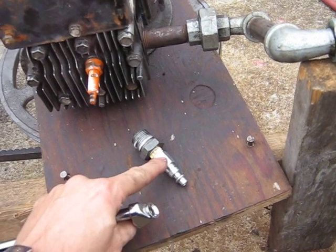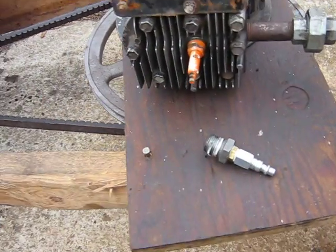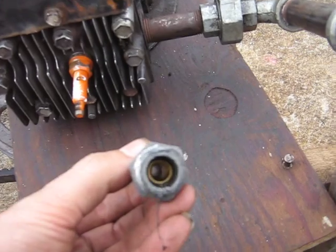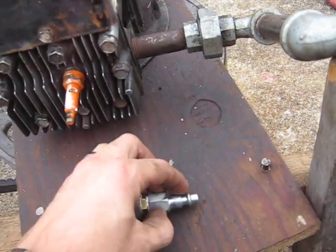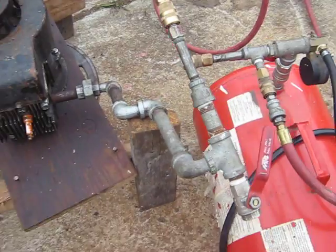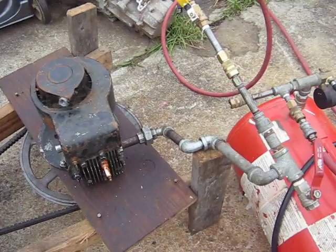At the same time I noticed that this was really hot — so hot I couldn't touch it. What that indicated to me was that there wasn't enough volume there; it was constricting the airflow out of the compressor. So I tore my big half-inch pipe contraption off my regular compressor and put it on this.